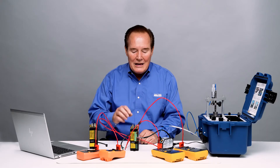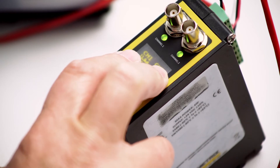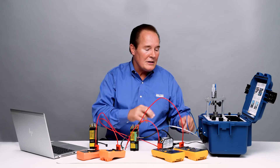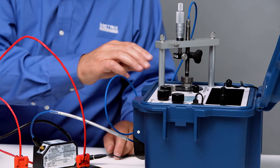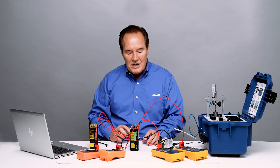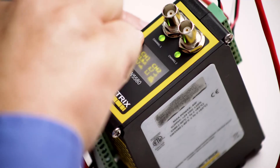So we're going to take a single channel in, two channels out — pretty easy. Let me describe my setup here. I've got a SW5580, and out of channel one we're getting a four to twenty milliamp position signal going into the multimeter on my left. Adjacent to that is a multimeter connected to channel two, which will show vibration.